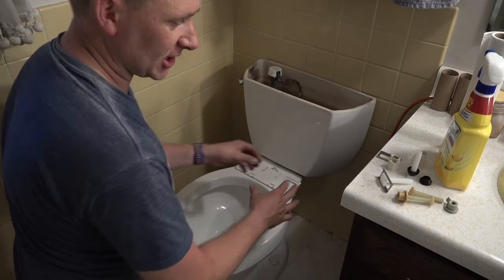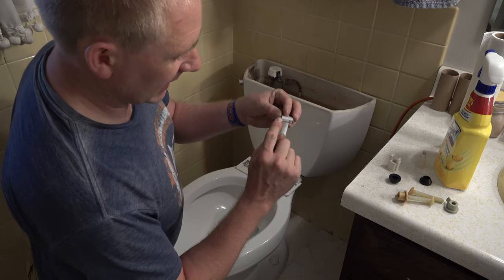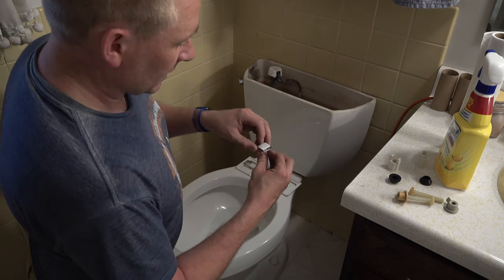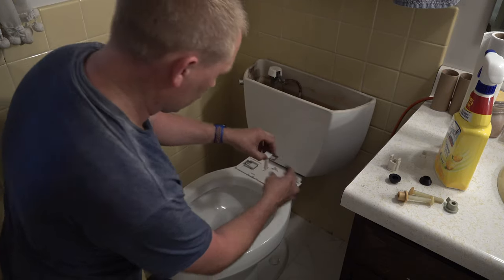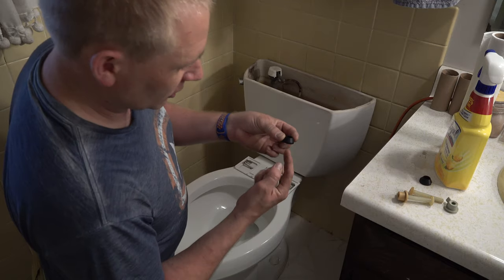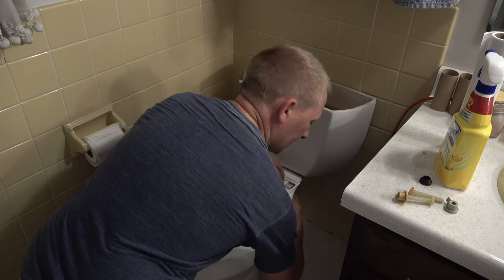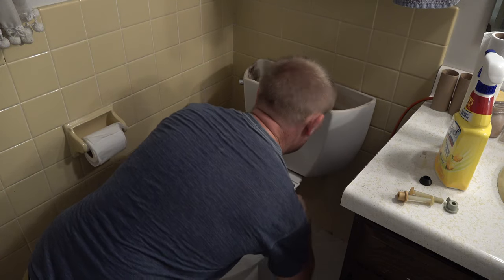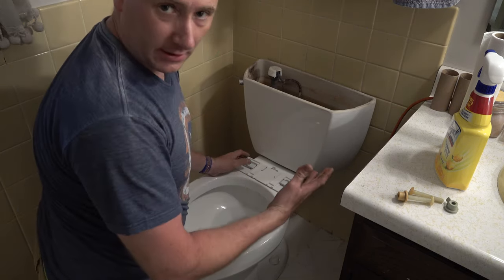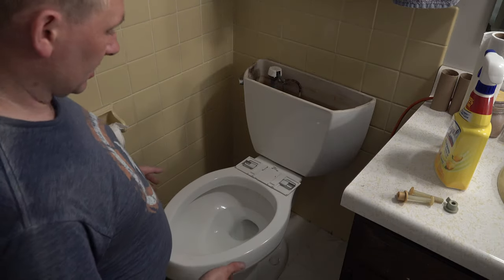The back plate goes back here like this and we'll adjust it later. When you drop the bolt through the hole, you can see there's a flange on it that faces up — it sits against the porcelain and holds itself, so you won't even need a slotted screwdriver to hold it while you tighten. Slide it in, then install the rubber washer cone-side up so it fits up into the porcelain hole, then thread the nut on. Get it snug but not cranked tight yet so we can still slide it forward and back and side to side to align the seat.